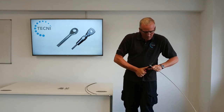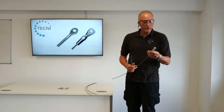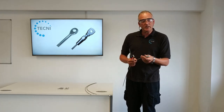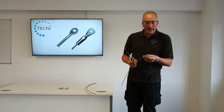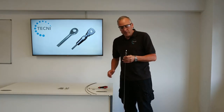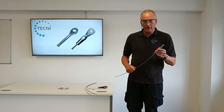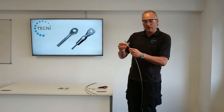Good practice with these is to leave them for about five to ten minutes after the first tensioning - that lets everything bed in. You can make them permanent by putting thread lock inside, and some people put silicone in for marine applications to make them more watertight, though that makes them much harder to disassemble. If you do take them apart, you can reuse the body but you must replace the gripper jaws and the pressure ring - they won't take another fitting and will definitely lose effectiveness.